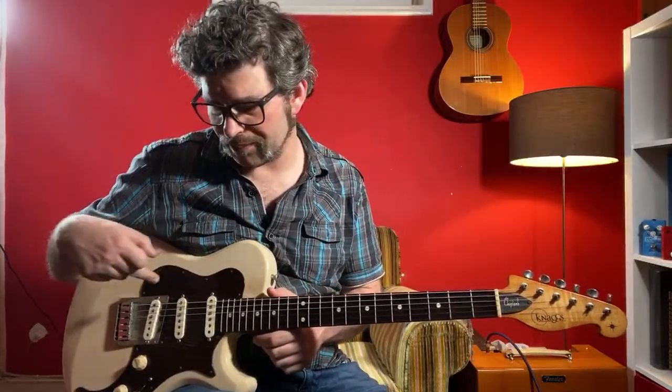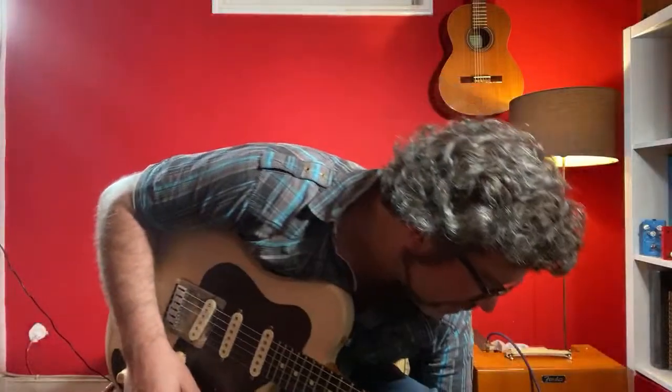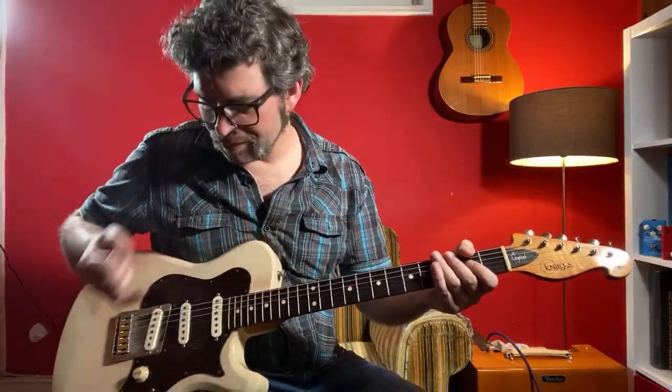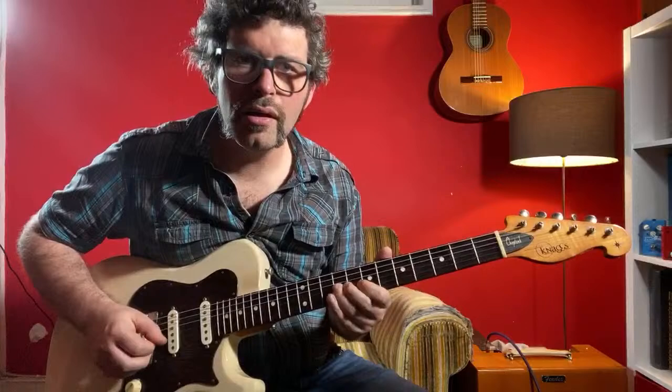My guitar has a treble bleed on the volume pot, and treble bleed is actually a resistor and a capacitor that you put on your volume pot, and it allows you to not lose high end. That's the only thing. So if I use, for example, my Janis Miesnekis, which is one of my favorite overdrives at the moment, very overdriven, I can now use my volume as my gain control. So I can lower it to 2 or 3, and I have my clean tone.